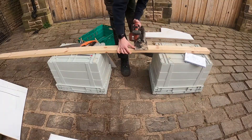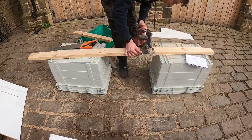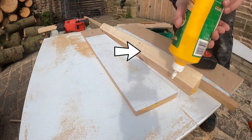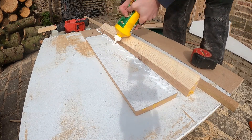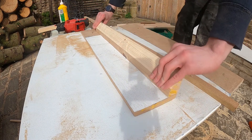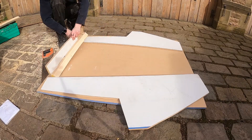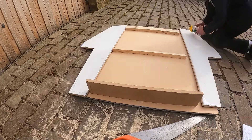And now I'm creating some braces for the back of the arcade machine. These braces are basically just going to keep the two sides separate from one another. Two of them are also going to make French cleats, which I'll show in a moment. So that's one of the French cleats there — I've basically just cut that brace down the middle at a 45-degree angle, and that's going to create a hook. There'll be an opposing hook that I can attach to either a wall or to a base that I actually end up building a bit later in the video. You can see that's the French cleat on the left and there's a French cleat in the middle, and the very bottom piece of the arcade machine is just a regular brace.